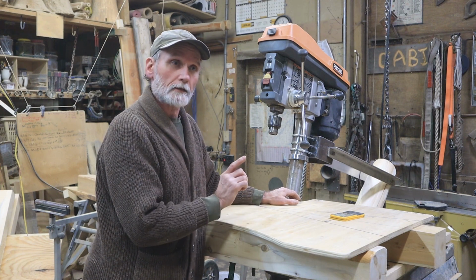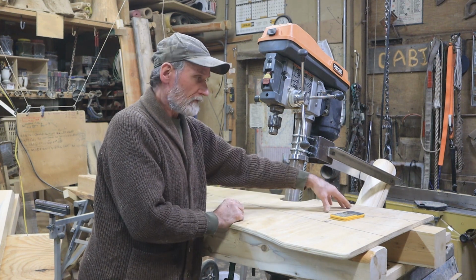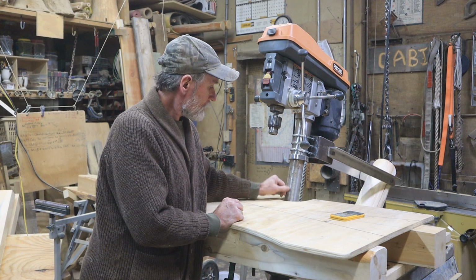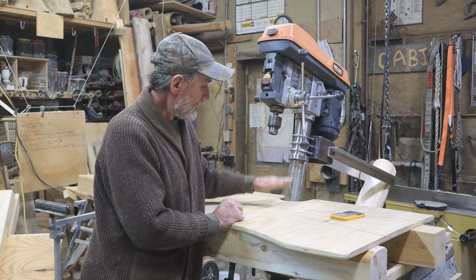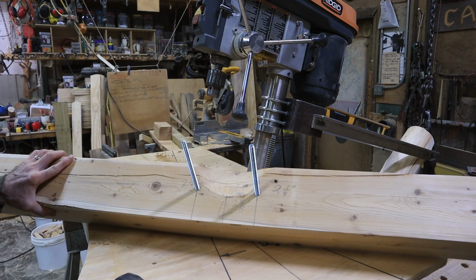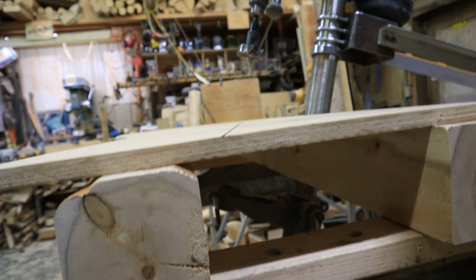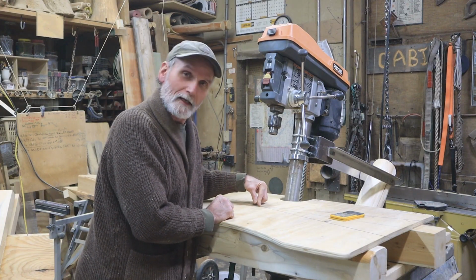Right now we're talking about the top, and some things that this created that work better than the other tilting column drill press that I have. The only oddball thing about this is the 5x5 on the back, and we sanded out a little bit on the base so that where we bolt it on the column, the tension point would be 2.5, or halfway down that 5x5. It's right in the middle, so we can clamp right at that point, and it holds tension really well. But that makes this table, as we lower or raise it by pulling the shims out from underneath, keep this center reference point exactly the same, which is a nice plus.